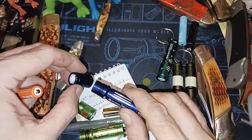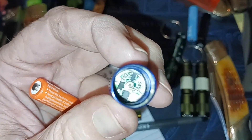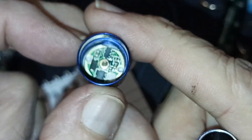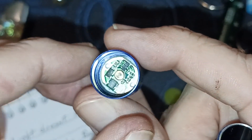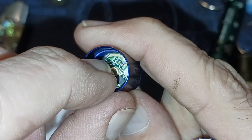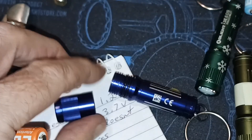I could see if it's not running the 1.2 volt due to all the little electronics in here — there could be something wrong inside. You've got a voltage regulator, I think, and some integrated circuits, resistors, and capacitors. But the main thing is that the center post is the positive connection and these copper rings on either side are the negative connection to the board. So your contact is coming from right here — that's where your voltage is being transmitted up.